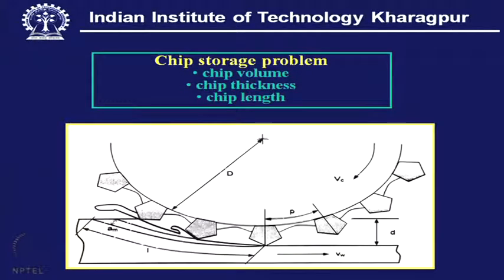The requirement of the abrasive tool: this is a circular wheel, rotary in nature, with grit materials bonded on it. In one ideal situation, we have some spacing and then the protrusion of the grit tip above the bond. These are some specifications of the wheel, and they cannot be independently chosen.